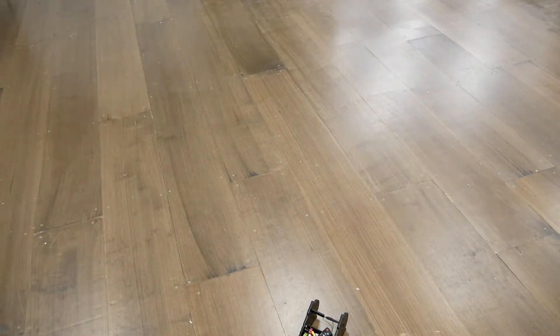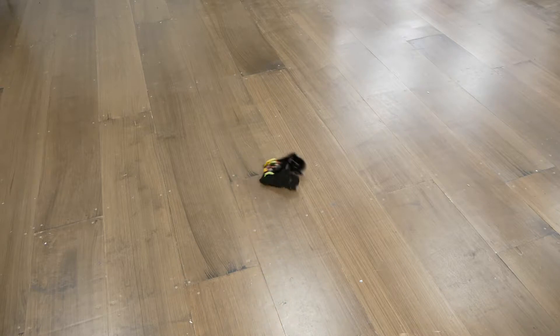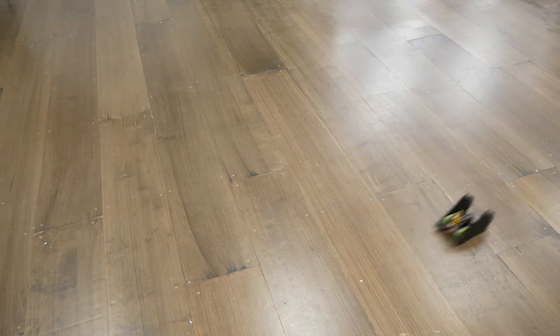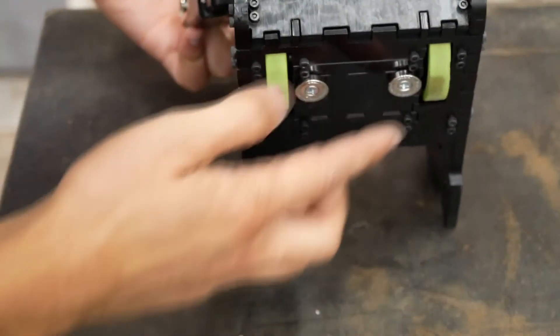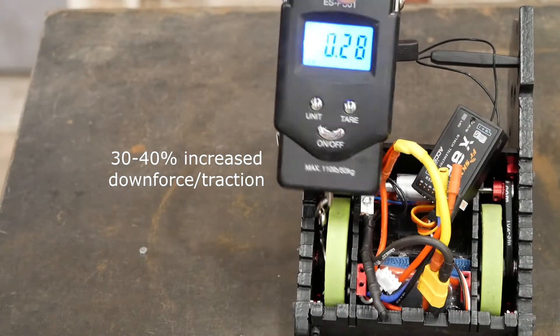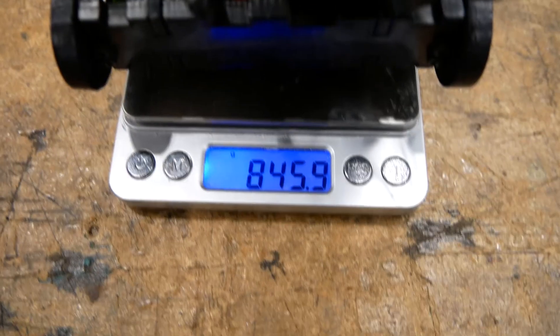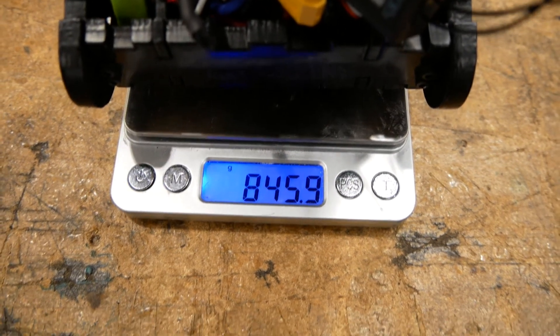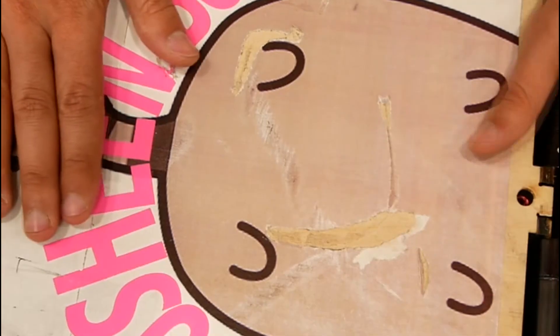The first test of driving. The floor of the arena is made out of metal for this competition, so I put magnets just by the wheels on either side. To see how effective those are at increasing the downforce, I have this scale here — the robot doesn't lift off until 1.38 pounds. These are all the parts that are not part of the weapon assembly, and everything else up to 1,360 grams can be put into the weapon.